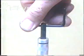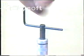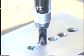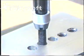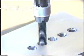Another tip: use two fingers on the handle to evenly distribute the pressure and not pull the tool out of line. Feeling the pressure relax, lift the body clear to see the end of the helicoil. When it is flush, give the mandrel a quarter to half a turn. The insert is now correctly installed.